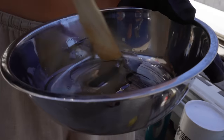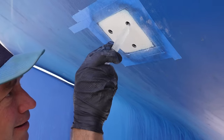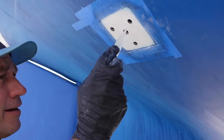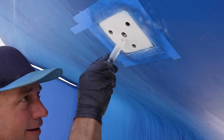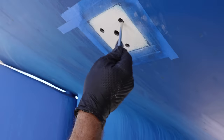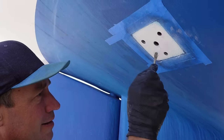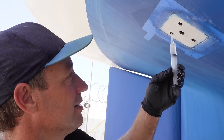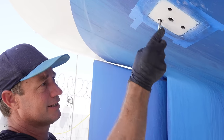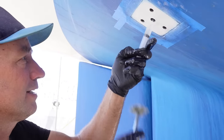Next step is mixing up the epoxy. When that goes in the hole it's expanded. I'm moving this thinned epoxy all around in the hole first before I put the thickened epoxy on. That way we get a nice bond to the core and a nice watertight seal. When I move this around in here, I've pretty much sealed the core even before I put the thickened epoxy in.